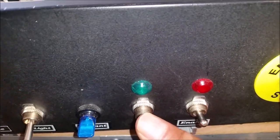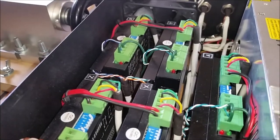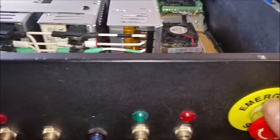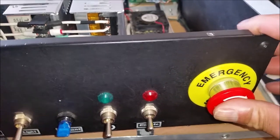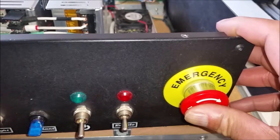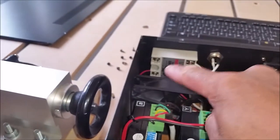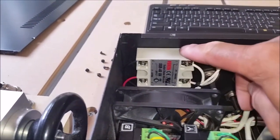If all three of these were on and I got into an emergency and all I could think about was to hit the power, it will de-energize the stepper motors so they can't move, and it will shut the 120-volt side off to the contactor. So I think all the bases are covered here. If I get a computer crash, it will not shut the spindle off — it would continue to run because it's on its own outlet — but if I push this now, it will de-energize the 5 volts, shut that off, and shut this off. If 110 is totally lost to this, obviously it's going to shut this off too.